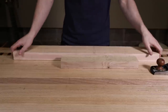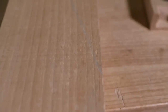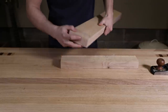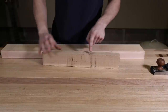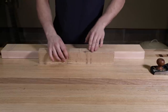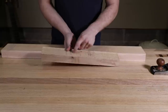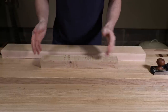Now before doing anything with this timber we need to analyse what we've got. Looking at this beech I can see along this edge there are some small splits — that can be from incorrect drying at the sawmill or from a strong storm that split the timber inside. There's also a split on the end grain here. Looking at the oak on this side, we've got a knot which is a dead knot by the looks of it, so when I plane over this surface there's a big risk of that knot falling out. It's not actually part of the timber anymore — a little bit dry and crumbly. It won't be a massive issue because that's our glue face, which will be hidden against the beech. I just need to be careful when flattening the surface not to expose it on top — we've got about one or two mil to play with.